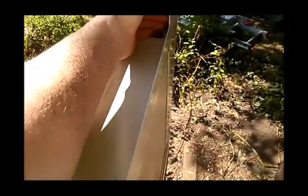So we have to create a dam here. You're going to take this, and we're going to slide it far enough because there's going to be a mullion on this window, and we don't want this tab to interfere with that mullion. So we're going to put it about a 1/2 inch in like that. I need you to goober all this up with silicone.